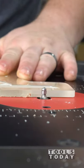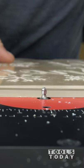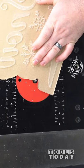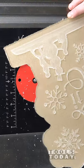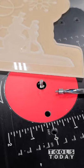I got it switched out for the mini round over bit. This is the MR0110, and it did a really nice job rounding over all of those edges and getting into those tight corners with that tiny 3/16 inch diameter ball bearing to ease over those edges. That's all done, so now we can move on to the base.